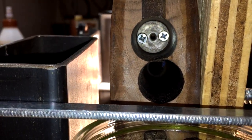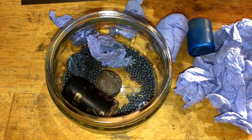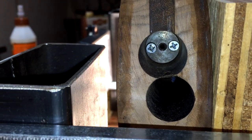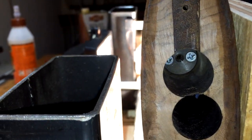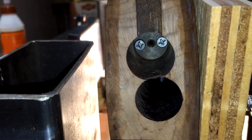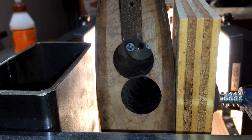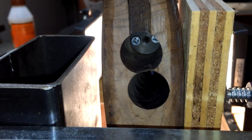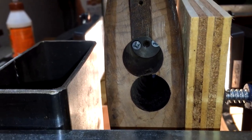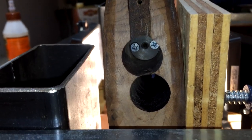When all said and done, the total — including the tissue paper, wads, hulls, and goodness knows what — is three ounces. I reckon I can put one of my solid slug counterweights in the top just here, which will amount to about three ounces as well, leaving that clear. My customer did say he wanted to maintain that weight — he found the counterweight beneficial. Putting a counterweight in the back shifts the centre of balance so the gun falls more comfortably in your forehand, and the extra weight has some dampening effect on the report of any shot.